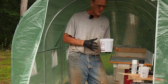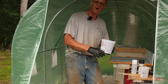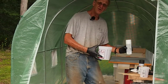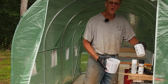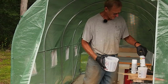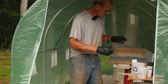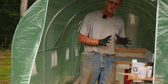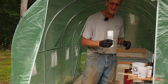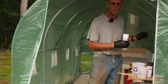With my countertops, I want them to be kind of light, so I'm going to make 2 quarts of the white epoxy using the Rust-Oleum paint to add the color to it. I'll make 1 quart of the black epoxy using the black paint for it. Put them on the countertop. I'll start mixing them around. Once I see what the color actually looks like on the surface, if it's too dark for what I want or the look I'm looking for, I can then spritz some of the white spray paint on it and work it in while it's all wet, and gives a good effect.